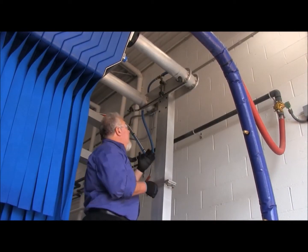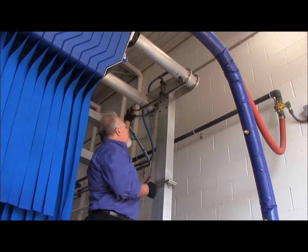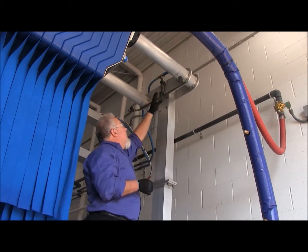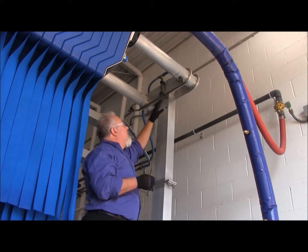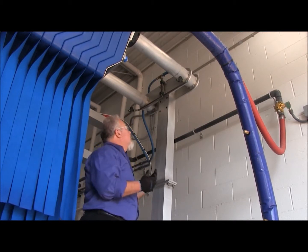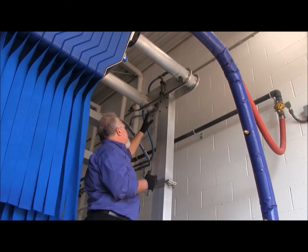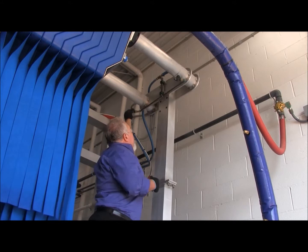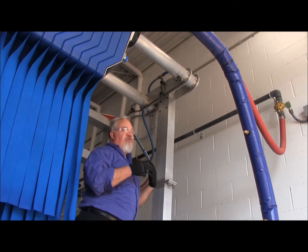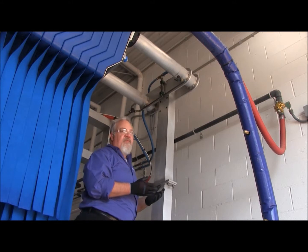Continuing with your mitter curtain, on the driver side and the passenger side, we have nozzles that will be spraying the soap and water mixture onto the cloth media. We have water connections up top. Now is a good time to give them a visual inspection — look and see if you have any loose hoses, any loose connections, if your nozzles are loose or in poor repair. We're going to be turning the system on at the end of our inspection to verify proper water flow.